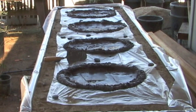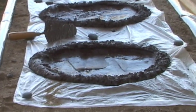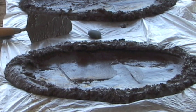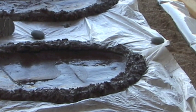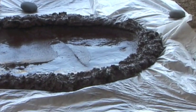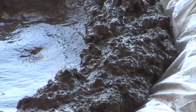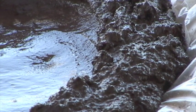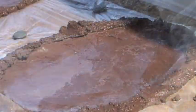Okay, I've got the floor poured, and you can see that water comes to the surface — this is part of that drying process. What I'm going to have to do is wait till it sets up a little bit more, smooth out the bottom, and do any more touch-ups. But that outside edge — you really have to stay away from it, because this roughness is what we're after. I also have to punch a hole, but I can't punch the hole till the concrete has set up enough so that it doesn't fill in on itself again.